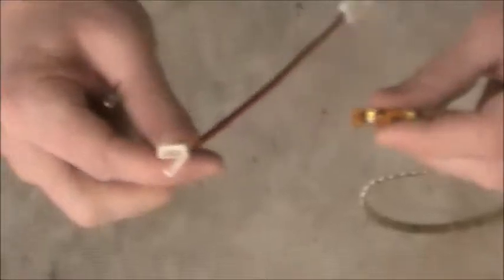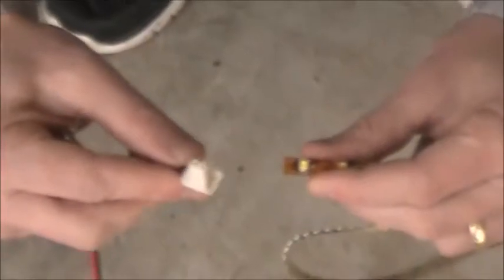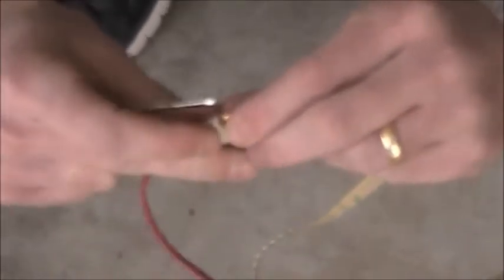I invested 5 bucks in these special connectors made for this, just to save myself from some soldering. Soldering isn't that big a deal if you're into it, but if you don't have a soldering iron this is probably the cheapest and quickest way to go. You use a jeweler's screwdriver to pop off the end, and they'll just puncture the LED strip to make contact right where they need to. Close it up and snap it in place.